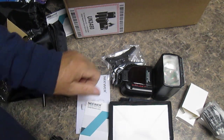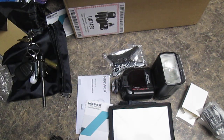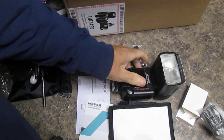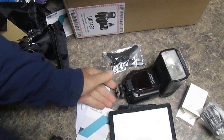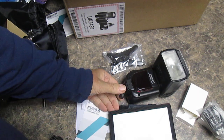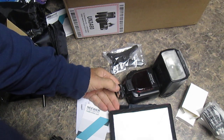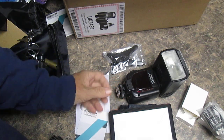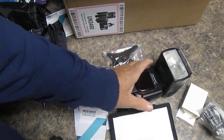I'm photographing a wedding, and I have some really nice electronic flashes, but they're for film cameras, and the voltage is dramatically different. If I put my old Vivitar flash on my digital camera, the 400 volts in the flash tube will go through it and burn it up. These ones are like 6 volts, so it's appreciably different.